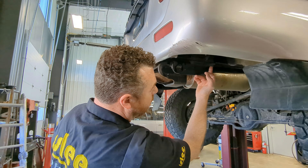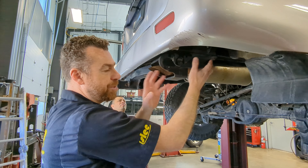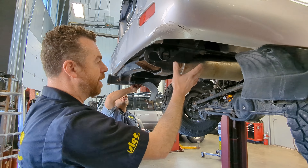The same applies to the bolt up front used for the wing support — take extra care to make sure these come out. The bolts themselves will not be reused. None of the hardware holding this bumper on will be reused, but we want to make sure we save the threads.